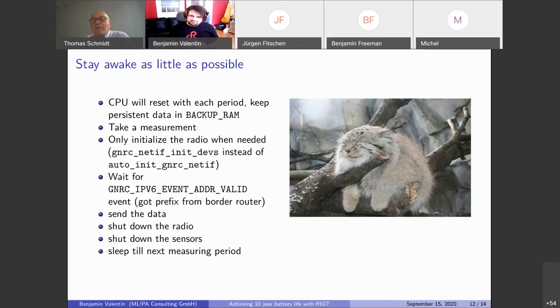Okay, we have other questions. One from Samuel online. He asks whether you're using ztimer and the power management layer for power management in the current version of your app. No, we're not using that yet because we'll just use pm_set(0) basically, and then go to this backup mode and wake up by RTC. So no runtime power management.